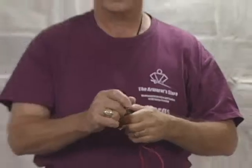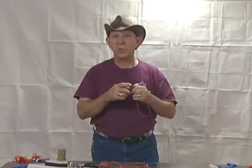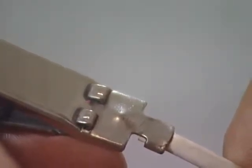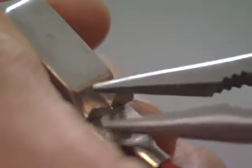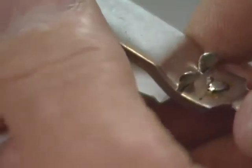Take a wire brush and brush off that corrosion, then put a light coat of either silicon wax or machine oil on it to keep it from corroding further. Another thing to check on your clips: the little retaining pins over time can work themselves loose and fold up. When that happens the clip itself will fall apart. To prevent that, take a pair of pliers, loosen them up, and twist those little prongs slightly about 45 degrees — that will prevent them from sliding through the slots and your clip falling apart.